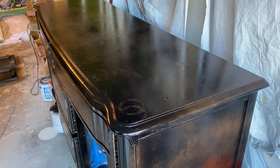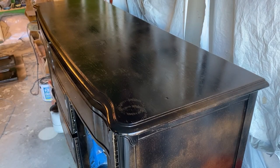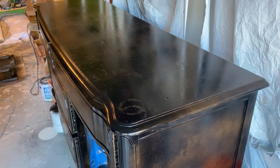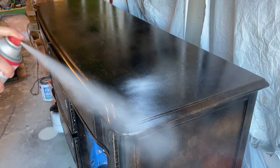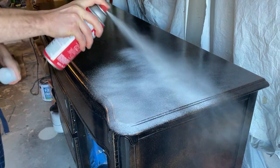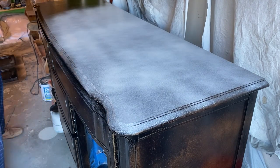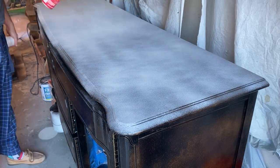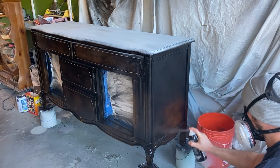And there were some more stains, some cup and water stains, as you can see on there. So I decided to put some heavier stuff on there, which is the Kilz oil-based spray. This usually cuts down deep into the wood and just gives it a cleaner finish. And then on to the second coat of primer.